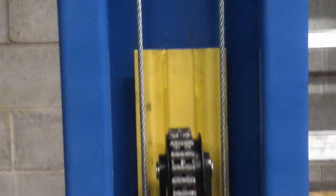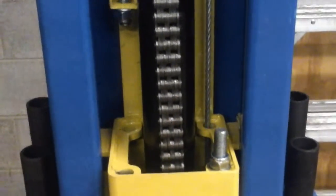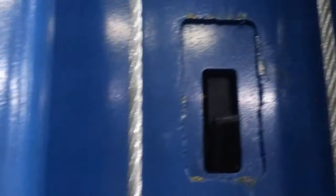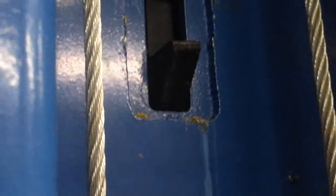You have your cylinder, your locking mechanism that's behind this yellow arm carriage, and your cable adjustment to equalize so both sides are lifting equally and engaging the lock at the same time. Here's what the lock looks like on the far side — as the carriage lifts up, there's a place where it catches so it can't come back down.